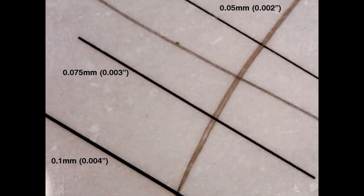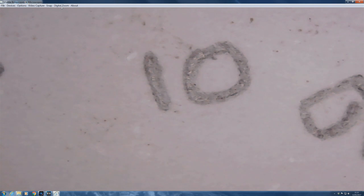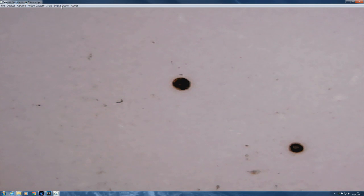A two inch lens has a theoretical spot of around 0.004 inches, or about 0.1 millimeters. So those bottom two lines on the graticule represent a one-and-a-half and a two inch lens — a theoretical laser line. Whether we can actually achieve that is what we now need to find out. I've looked at both machines under the same conditions: pulse set to manual control at 12 milliseconds, and power on both machines at 15%. I've then purposely set the focus above and below the focus point for each machine.